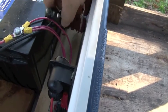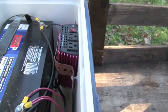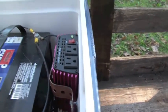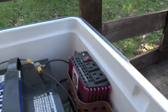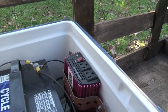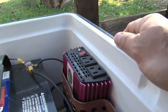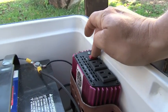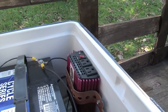One of those power ports is being used by this converter — it's a 400-watt inverter. You can power that on and have AC electricity as well. But the inverter will take maybe 30% of your power, and the bigger ones have fans that create an additional draw. So this stays off until it's absolutely needed — if you just leave it on, it'll drain the battery.